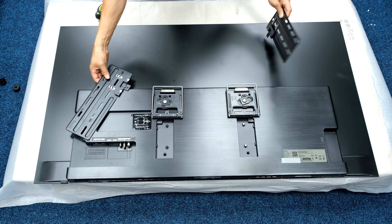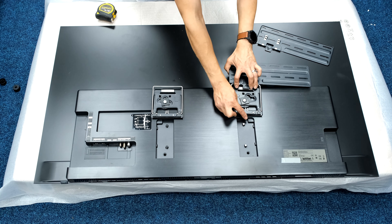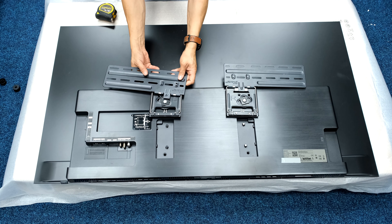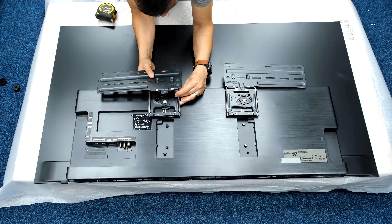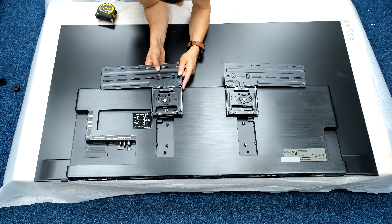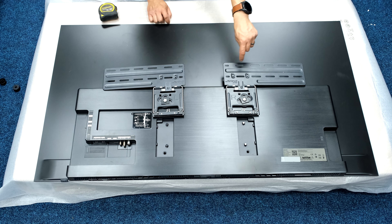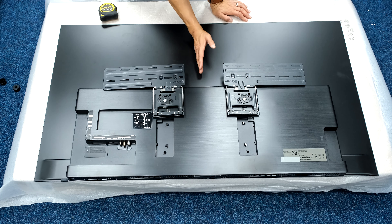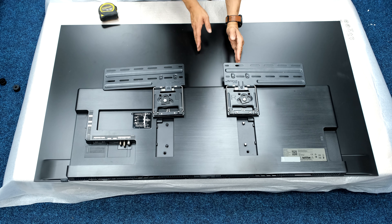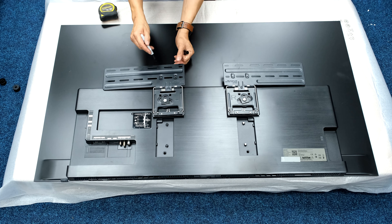Pull these arms up, plate onto each one, so now I can click those in place. I can get it measured up to help me mark the wall out — that wants to be set about midway, same for this one. I can get it in the right place, center that, click it in, push that down. I'm going to mark from the top of the TV down to the center of that hole, with the same line across. I also want to know from the center line outwards to that hole, or I can measure between them and divide by two.